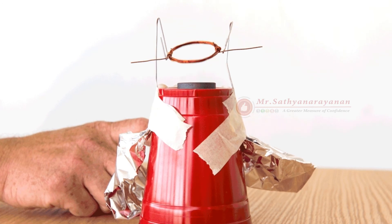Once moving, the coil can continue to spin until the battery is dead. The reason that the coil only spins in one direction is because spinning in the wrong direction will not cause the magnetic fields to repel each other, but attract.